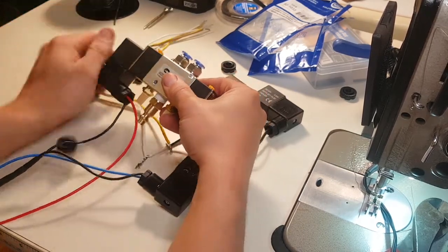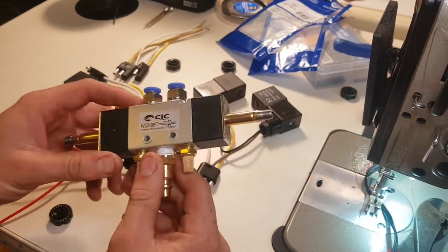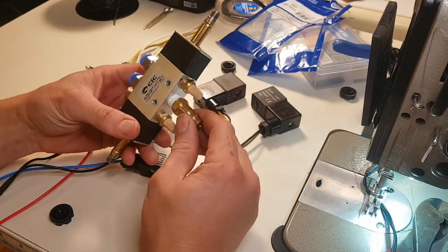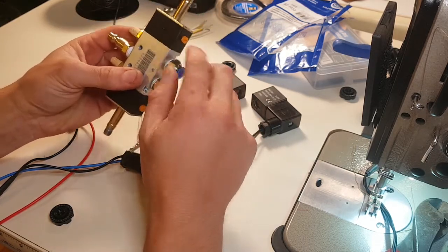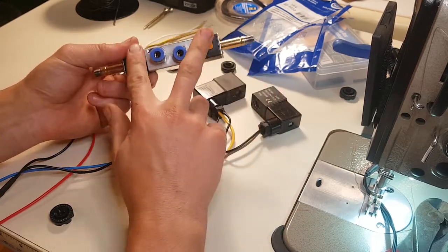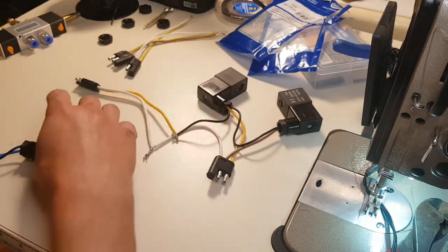That's how these components can be wired off of the machine this is installed on. Like we said in the other video: one-eighth inch NPT silencers, quarter-inch NPT brass male fitting, and then two quarter-inch straight outs — one for the hose and one straight into the solenoid. These are the manual actuator override buttons right here.